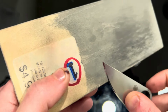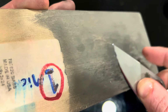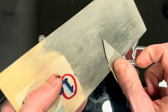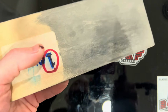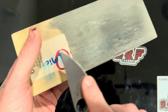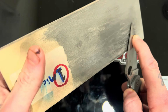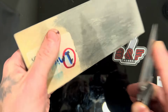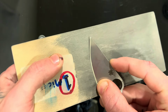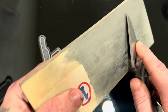The lower you go in micron and the more refined your edge bevel gets, the smoother it feels. And you really want to pay attention to the feedback that you get from the strop. Feedback just means I can feel a certain amount of vibration, if you want to call it that, in the strop as I drag the knife across it in my auxiliary hand. And then in my hand that's holding the knife, you can feel the difference when you are taking it across the strop.